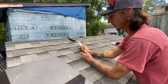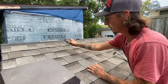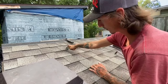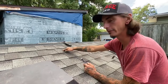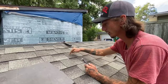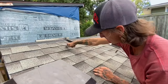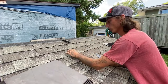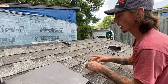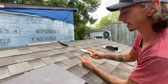Now that we've got to our second side, we're going to go ahead and cut the same line out. Make sure when you're cutting through your shingles, you go once — but that only cuts this shingle and the face of this shingle. You still have to cut the top of the shingle below this, so you're going to want to go over it again, pushing very firmly down onto the roof deck, making sure you're getting all the way under. You'll feel the plywood with the tip of your knife.